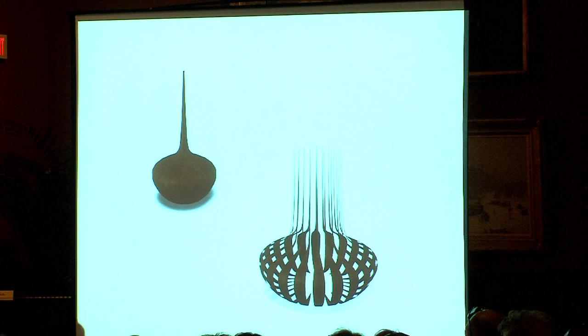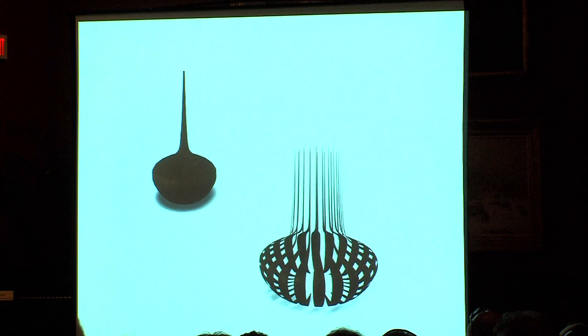So this is a 3D model rendering on Rhinoceros. There's a curve that's rotated around an axis. The model here on the left is put together. Here's what it looks like before you put it together. It's made out of all these laminations of wood. Laminations are just strips of wood that are laminated together on a mold with glue. When the glue dries, you take the laminations off and it holds that curve. So I can make 30 of these little parts identical to each other using a mold, and then I cut them to the right angle and put them together.